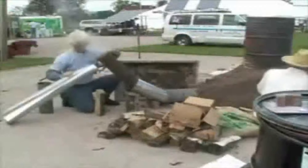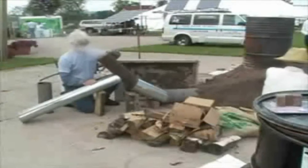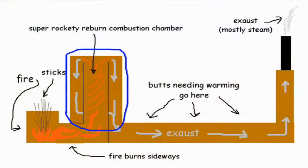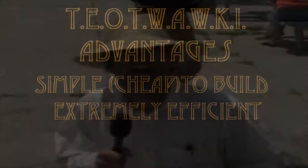To fully use your fuel — to get the most heat and the most utility out of the fuel that you put into your rocket stove — link the combustion unit with a mass which will then absorb that high temperature heat and release it over a longer period of time after the fire has gone out, at lower temperatures but still pleasant temperatures for indoor space heating or indoor contact heat.